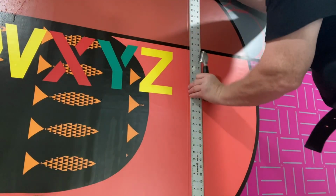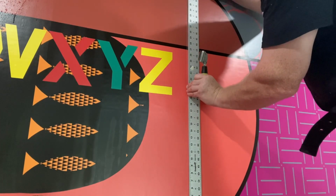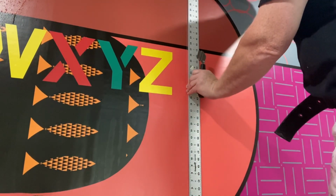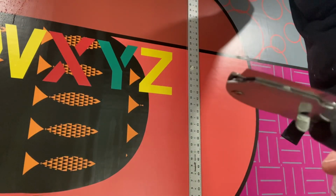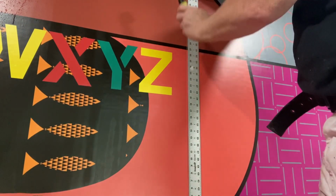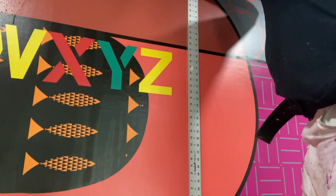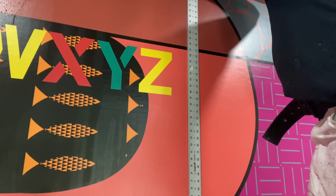Okay, let's do it. Put my 48-inch guide against it. I'm giving myself less than 1/4 of an inch. Like I just said, cutting it as close to the edge as possible. I flipped my blade around, so I got a new edge. And for a length this long, I'm going to switch it midway. Not always the greatest idea to stop midway, but you want the blade to do the job.